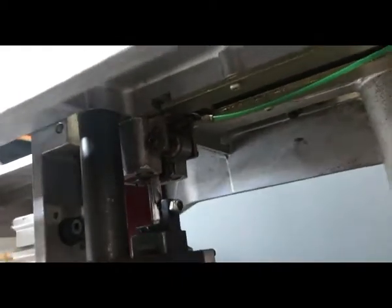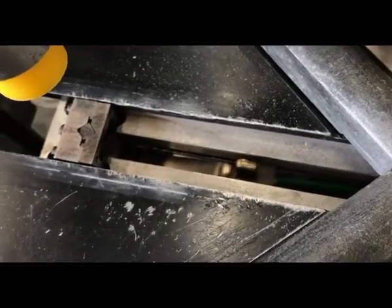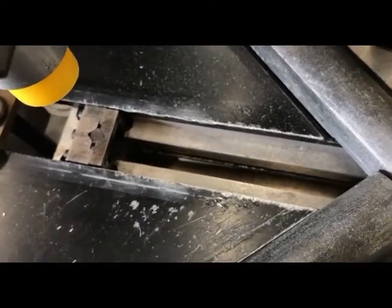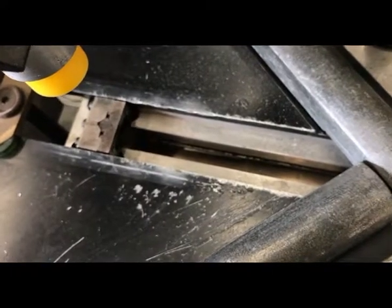Now you should find that we're done. We've got a new spring on the wedge pusher, which will push nice and firmly into the cartridge-loaded wedges for your CS88 and 89. So that's how you replace the spring on your CS88, 89 and also your CS79 underpinner.